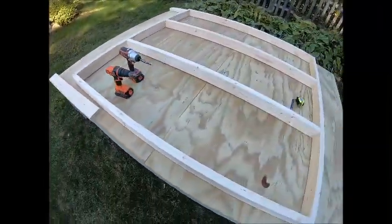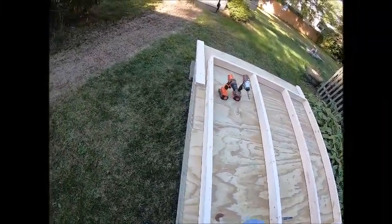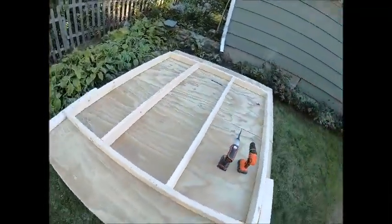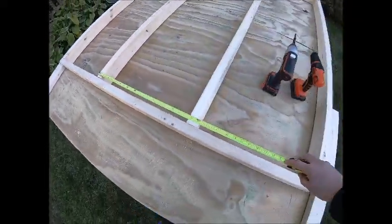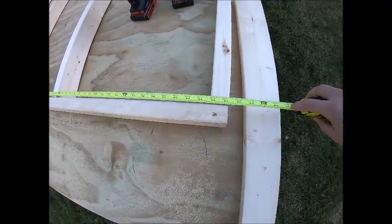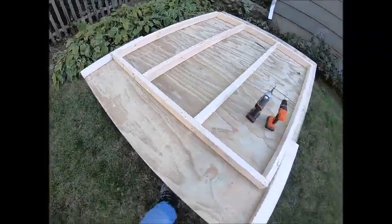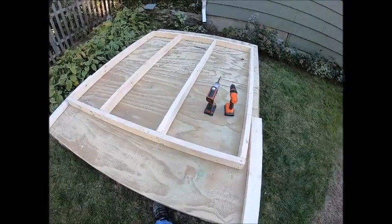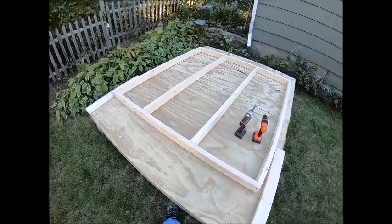Look at the bow in that 2x4. These are a little different than the other ones because you need one that is 48 on center from the very edge of it, and there's another wall there. So that one is actually measuring about 45 1/2, which will make it 48. These aren't load supporting, so there's technically only 2 in there. But yeah, that's where we are. I got to make 1 more of these, then I'm going to call it a day.